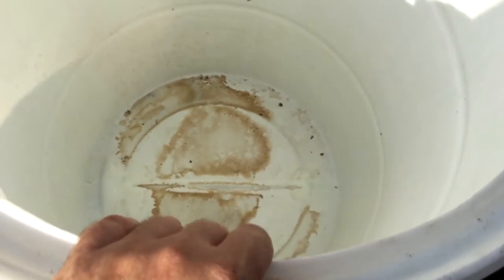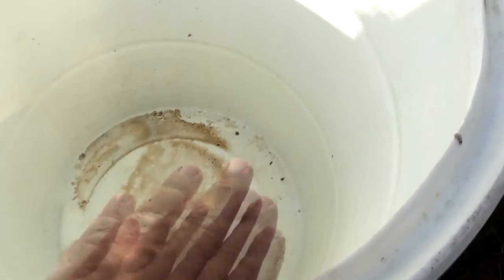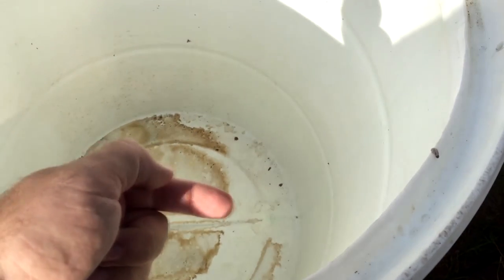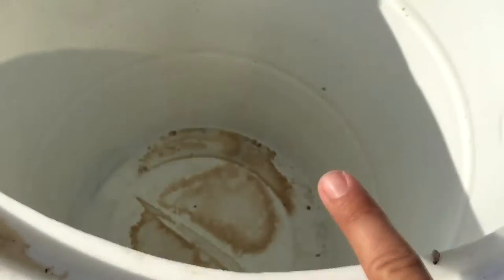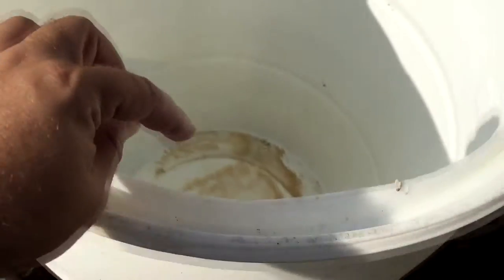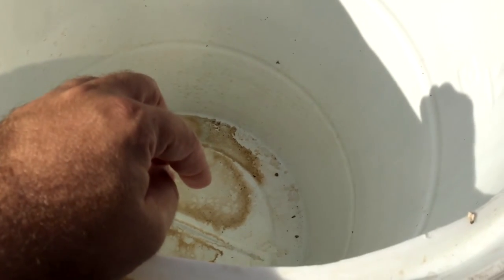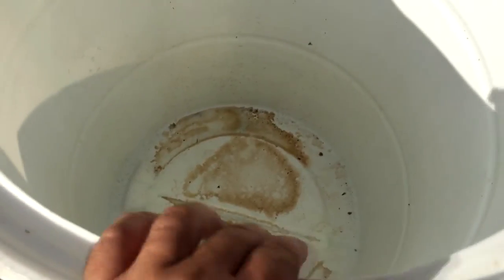So that's kind of how I'm going to plumb it. I'm going to have a drain at the bottom. I see a lot of people drilling holes through the bottom and having the barrel up on a brick, then drilling holes in the bottom and having a tap. But you really don't need to do that — you can drill in through the bottom, about an inch up, and just have a little 90-degree that points down and almost touches the bottom of the barrel. When you go to drain out any built-up solids, you just turn on the tap and it'll pull it up and out through that 90 and out through the drain. And I'm going to have it come out here somewhere, because this is outside the aquaponics system, and then I just put the stuff into my plants or garden beds.